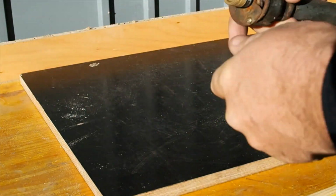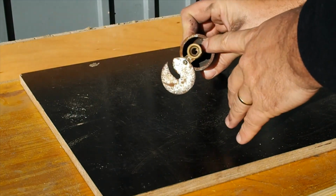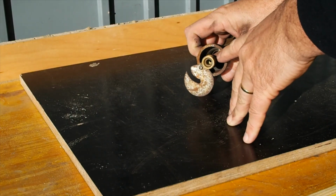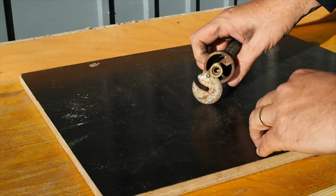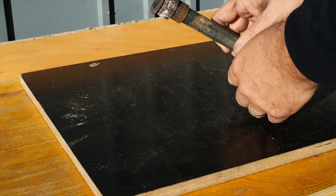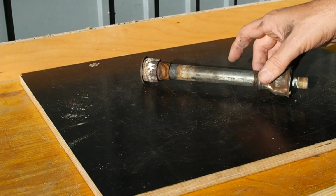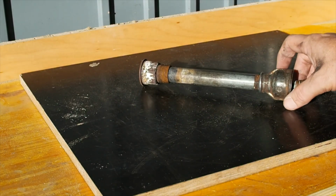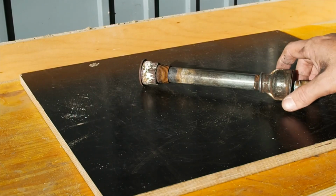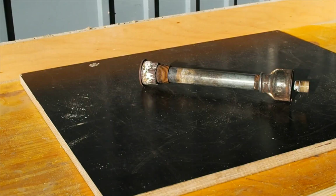Has an air valve, a MIG torch nozzle in there, and just connects to a normal gas bottle with a flare, of course, to stabilize it when it's not used in the furnace. I quite often use this for bigger brazing jobs or heating jobs, and in the furnace I use it turned right down to burn out the PLA if I do a lost PLA casting.